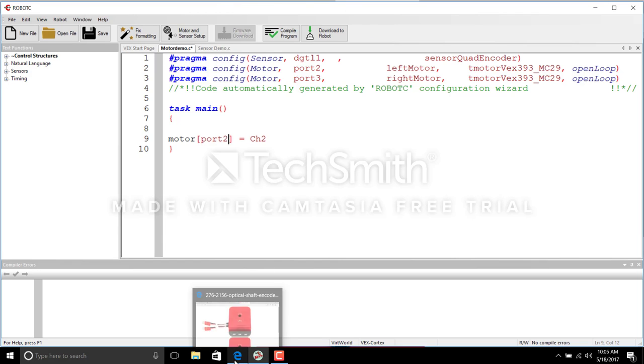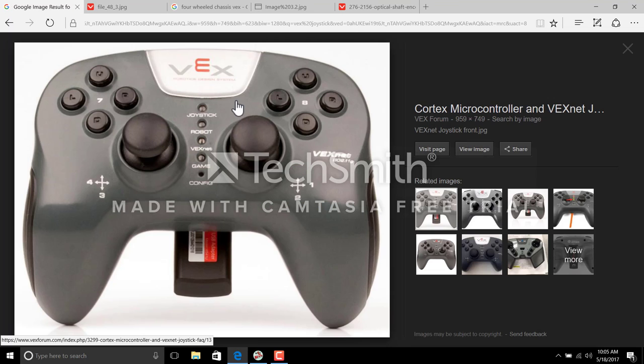And if I have a joystick near me, this would be a typical VEX joystick, and if you look at it, there's labeling here 1, 2, 3, 4, and so on, 7 and 8, and you even have markings saying U, D, U, R, left, and D. What basically these things refer to is channels. So when you're trying to configure a movement of the motor to one of these buttons, say I have channel 2, and if I press this toggle I want my right side motor to move forward, and if I click down, I want my right motor to move backwards, and so on for the other channel 3, which is here. That would be a typical ergonomic way to do it.